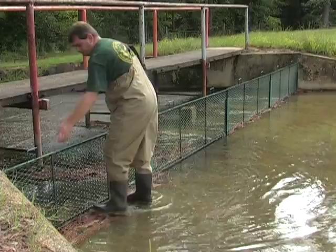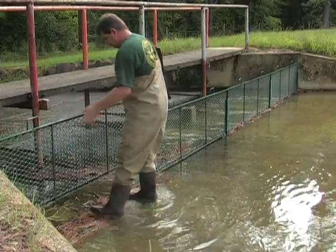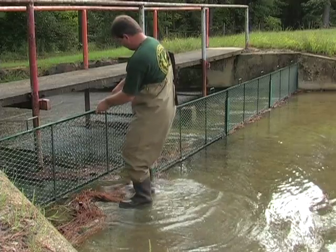In general, the barrier should be at least 16 to 20 inches high, but never more than half the depth of the spillway. Even a properly constructed barrier will require periodic cleaning after storm events.